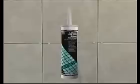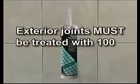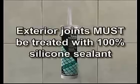Filling the joints between veneers installed with Lat Epoxy 310 can be accomplished via two methods. Interior applications may be grouted with Laticrete Spectralock Pro Grout or Laticrete Tri-Poly Fortified Sanded or Unsanded Grout. For applications where grouting is not possible due to larger spacing behind the veneer, use Laticrete Latasil tile and stone sealant with the appropriate backer rod. All exterior joints between veneers installed with Lat Epoxy 310 must be treated with only a 100% silicone sealant to allow for movement in the facade.